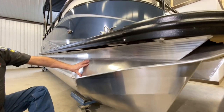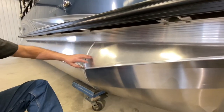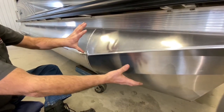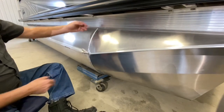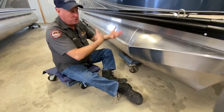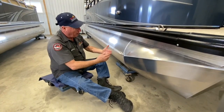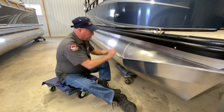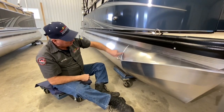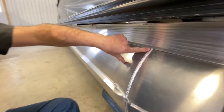How they install this — and I know this is a little more technical, but it's good for you to know — basically, this area in here is crimped, and the nose cone actually fits into it. Then it is welded all the way around by machine. The machine rotates the log so the welder doesn't have to physically move much; he can just sit there and do a really good job. When they talk about stacked dimes, well there they are — stacked just like dimes. That's the mark of a high quality weld.